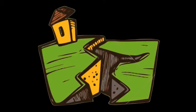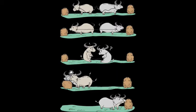Now you can imagine that there isn't such a thing as the ideal, the perfect, the theoretical ground whose electric potential is always and unchangeably exactly zero. Technically, it isn't even necessary to be always 100% unchangeable and 100% exactly zero without even the smallest fluctuation. But what is really necessary is that all devices which shall work together and which exchange electrical current, electrical signals, share the same electrical ground and undergo the same tiny, tiny changes of the electrical ground at the same time.